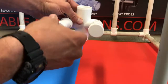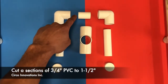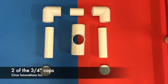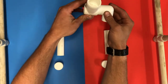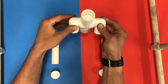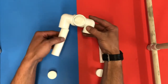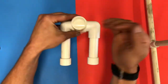This is another option for the one inch design hinge. It's a little more cost effective because you're not using as many fittings. On the top we have one section cut to an inch and a half — that's three quarter inch PVC pipe. We have two sections of three quarter inch PVC pipe cut to four inches — that can be any length you'd like. We have two L's that are three quarter, one slip cross that's one inch, and two caps. Place the inch and a half section into the L. You can glue that — glue it separately, let it dry. Then put your slip cross on, and put a little bit of glue on the fitting inside just enough. Set it flat on a nice flat surface, let it dry, and every few seconds check to make sure the glue is not impeding movement. After that's dried, put in your four inch sections or whatever you desire, put your caps on, and you're all set. Plug that into your doorway and there's your latch.